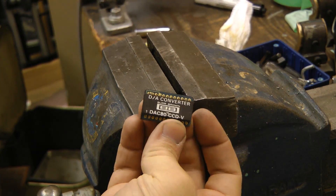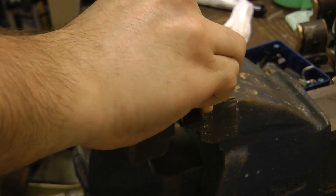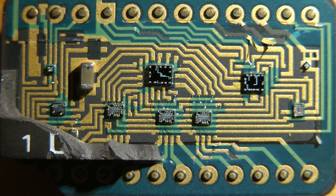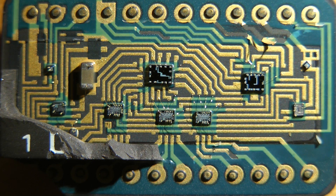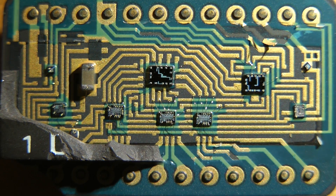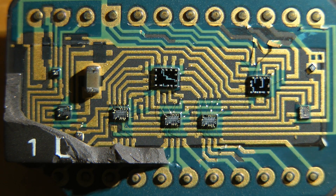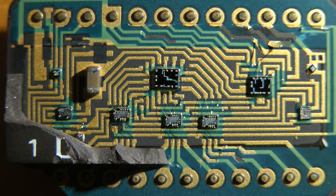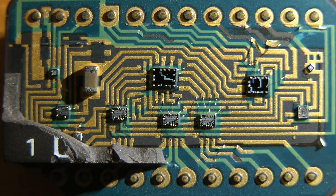Let's see what's inside this DAC. There's the inside of the DAC: numerous small dies, two bigger dies, and one filter cap. Notice some nice star point grounding near the top left. I'm thinking the 12 digital inputs are on the bottom of this, then there are three or four input buffers. The center die is probably something like an R2R ladder to actually produce the digital-to-analog conversion, and there's probably some sort of buffer or op-amp after that. That center chip looks like it has some sort of laser trimming marks.